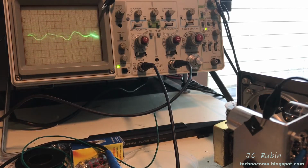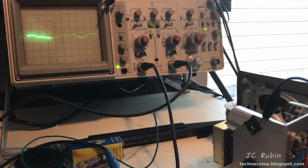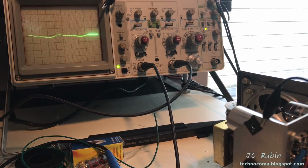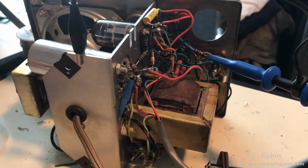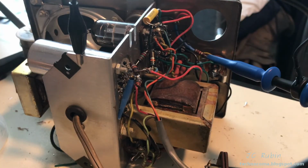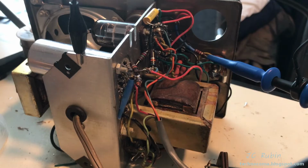So that gives me a good reference to work with. I'm also interested to know the input right after it leaves that jack, what it looks like. So I'm going to measure from a known test point as well. And I've decided to go right off of here. This is right before that resistor coming in on the jack to see what the guitar produces.